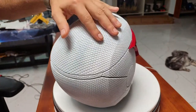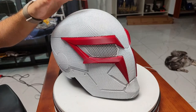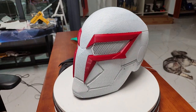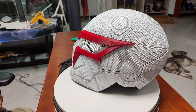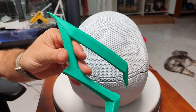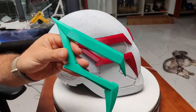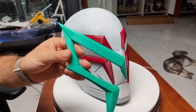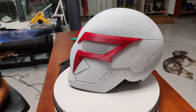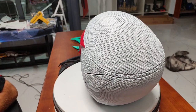I usually always print at 0.2. This one I printed with a Flsun V400 because it doesn't fit on the Prusa or the Bambu P1S. This evolution of printers means you don't need to do post-processing. Look — this is PETG and it's already very good. Just some supports to remove, but look at this one: printed like this, no smoothing, no sanding, no polish, no paint needed.